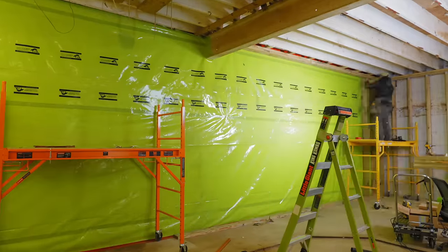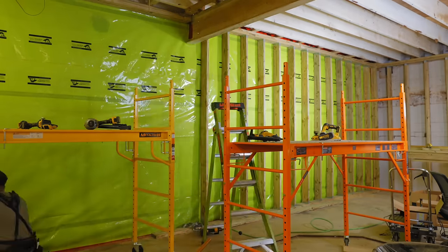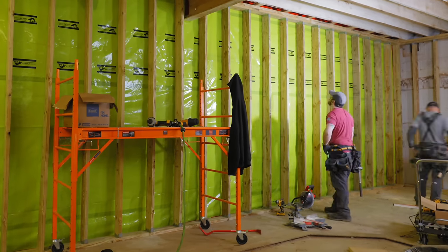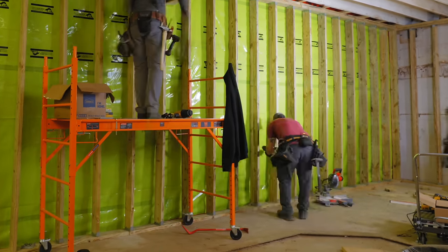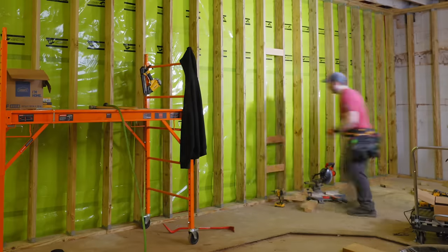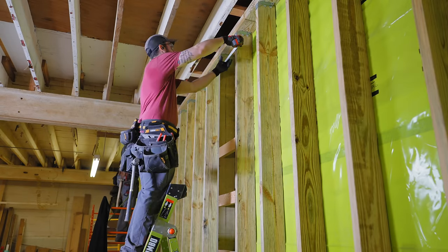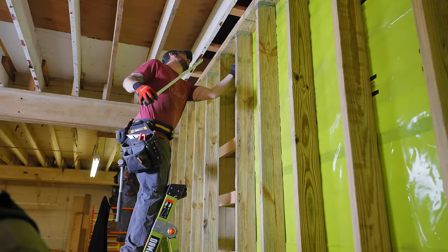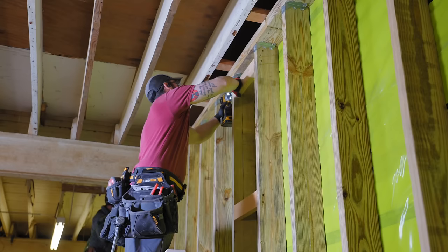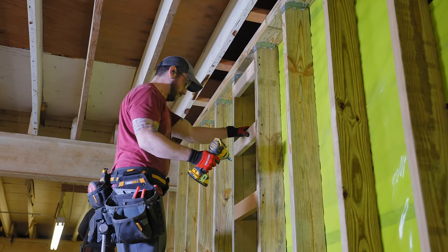With the vapor retarder installed, we got to framing the back wall — really more of the same, except we needed to add blocking where the top plates landed between the floor joists above. While the guys wrapped up framing the rest of the wall, I came back and added blocking where the walls for the CNC room would meet the exterior walls. Rather than the typical stud pocket, I used a ladder blocking style, which saves a ton on materials and lets me use up lots of short offcuts. The only difference will be paying more attention to this blocking location when adding the plywood wall sheathing.